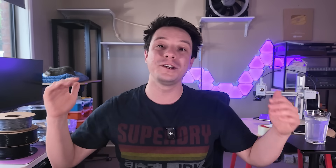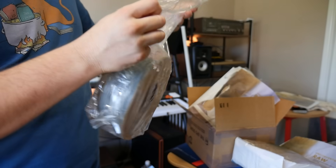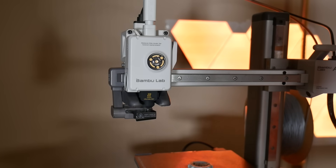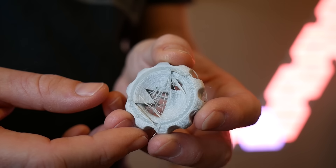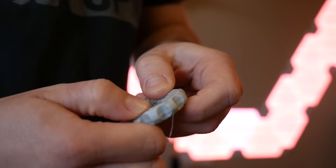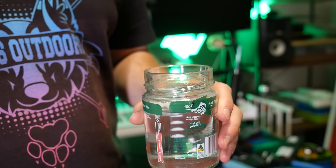Printing with Time Mass filaments is challenging, to say the least, because they dissolve in water — they're basically a sponge for moisture and need to be dried extensively before you even attempt to print. The company doesn't ship them in vacuum-sealed bags for environmental reasons, so expect to do a lot of drying right out of the box. I had this roll in the dryer for two days at the recommended temperatures before printing the test maker coin and it still boils and spits angrily out of the hot end. If you can avoid crossing perimeters, the actual print is clean enough — they recommend a 0.8mm nozzle rather than the 0.4mm I usually use. The resulting print looks and feels like solidified PVA glue, has a vinegary smell, but it's a lot more flexible and quite tough.